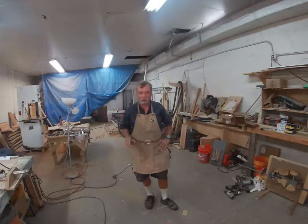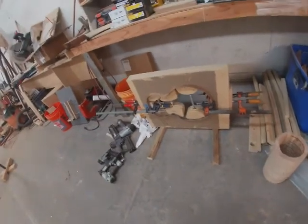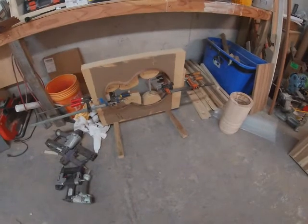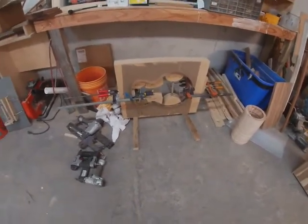We're going to continue on. I need to do the rosette on the soundboard so that I can then place the bracing on the back of it. And that will be the first part that goes on to the sides. You were with me with the sides yesterday — finished them up, and they're now connected to the interior bracing. As you can see right here, it's all braced up. The neck block and the butt block are in place. So once that dries up, we can put in the kerfing. Actually, we have to put the soundboard — the front — on first.